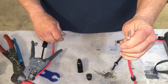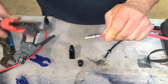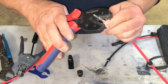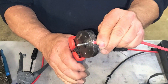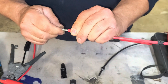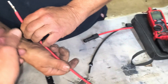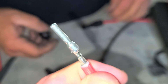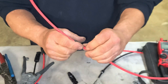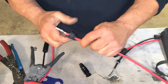There's a double crimp technique — not recommended in any installation manual, but it adds a second crimp right above where it crimped onto the wire. Those two crimps there and there give better connectivity and fewer problems. You're talking about a pretty small surface area for connectivity, and you can carry a lot of amps on these — not having good contact will certainly cause problems.